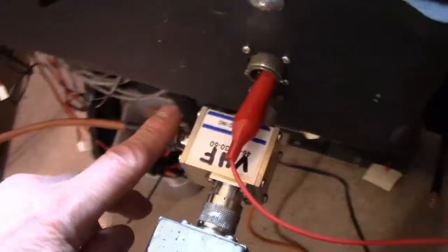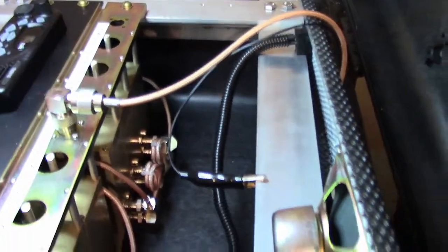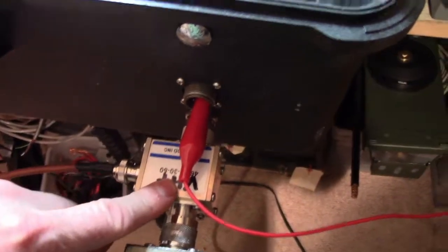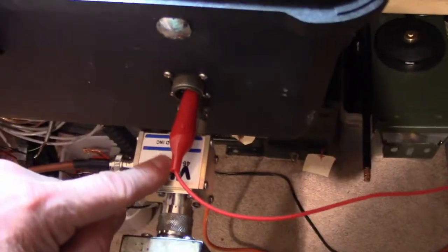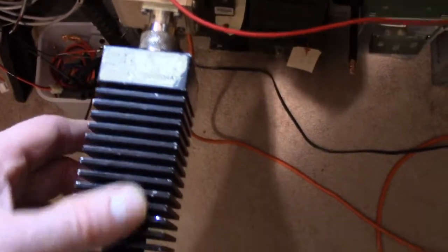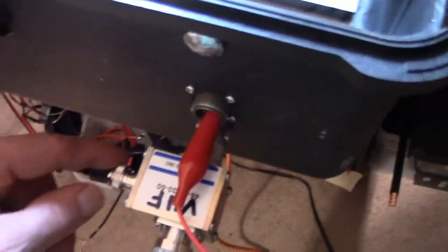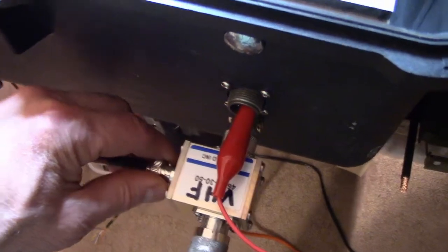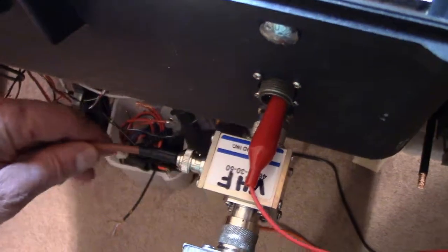In this test, we're going to use a coupler, better known as an RF decoupler. This is a device that goes in line from the RF output. The RF cable is coming down through here and down to the side of the pelican case, so we're essentially connected onto the center pole of the duplexer. It comes out here, and inside this little box is a coupler — just a piece of metal that basically connects the two inner pins together. There we have a 50-watt, 50-ohm dummy load. Off here is a loosely coupled BNC connection that gives about 30 dB of attenuation or isolation.